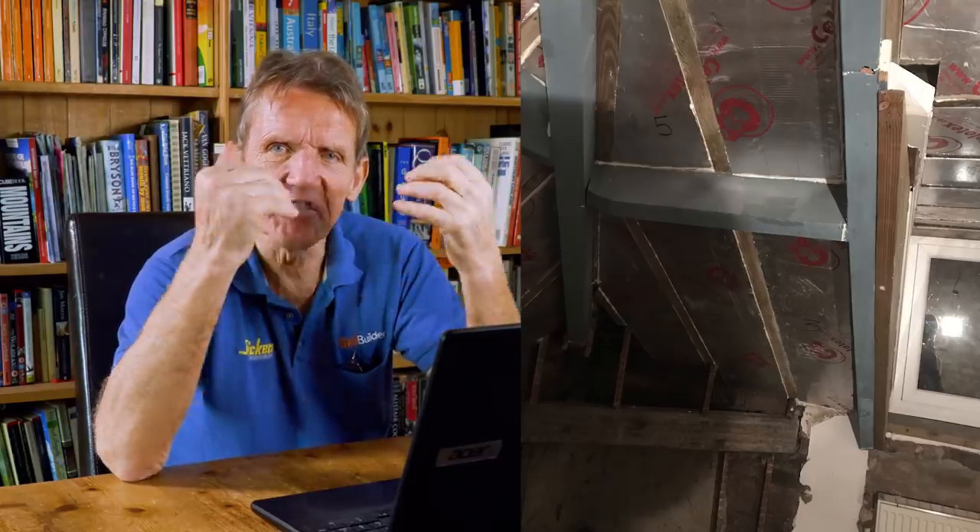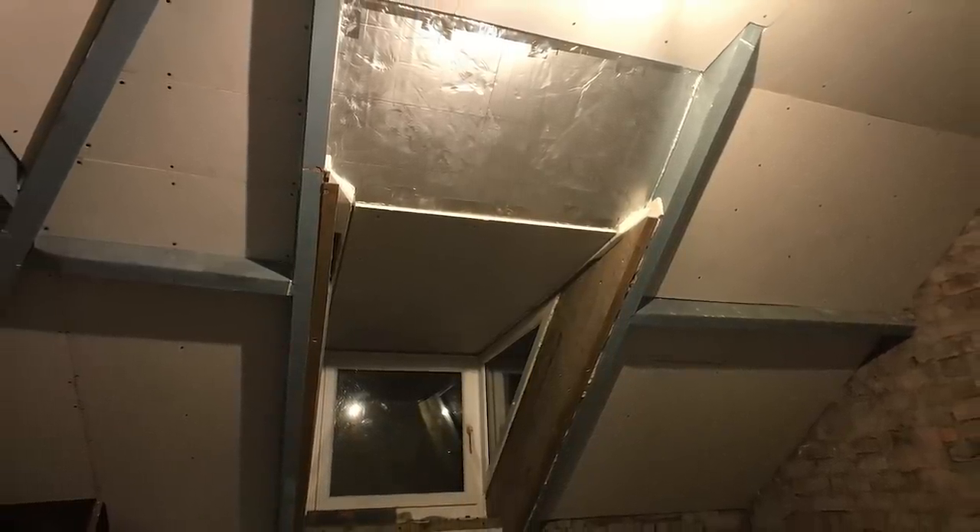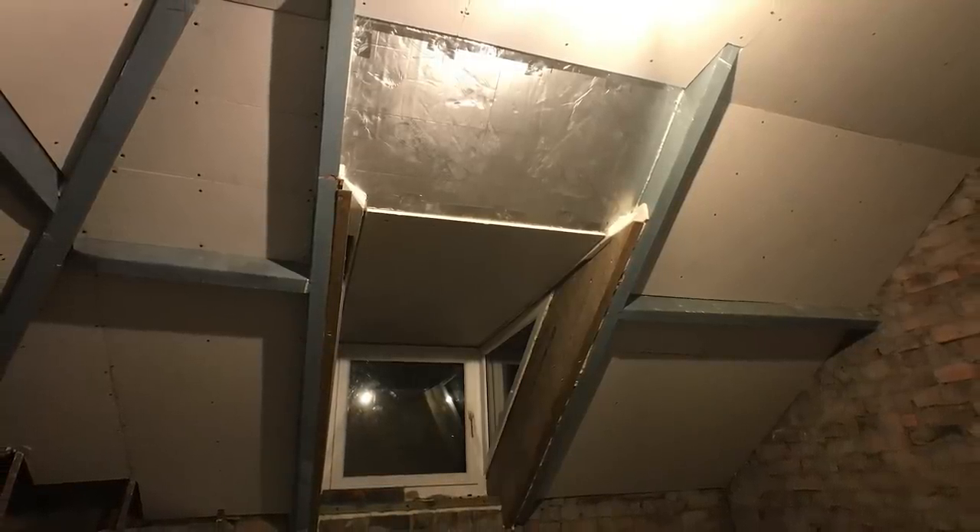If it's an old-fashioned roof with open tiles or slates, that's fine — you get a draft going up and down. The worst scenario is having a small air gap and then old-fashioned bitumen roofing felt that doesn't allow moisture to escape, causing condensation. That's why we now have breathable roofing felt. If you haven't got that, put vents at the bottom and top to get a flow of air up the outside of the insulation board to clear moisture. You need either breathable felt or ventilation in the air gap.